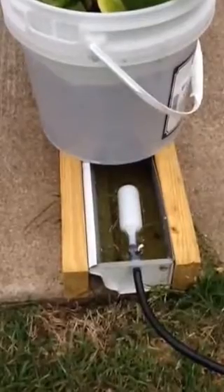After I completely waterproofed the gutter on both ends, from Amazon you can get this little float valve right here. This works just like a toilet valve. You screw a hole into the side of your gutter — I'll show you this one because it's more of a direct screw. So you screw your hole into the gutter right here, put the float in, and then adjust the float valve so that when the float valve goes down, the water comes in from the rain barrel.